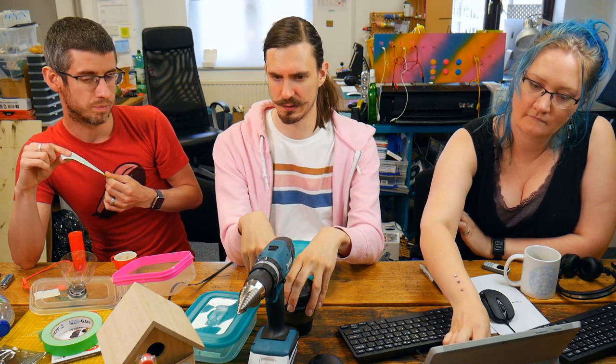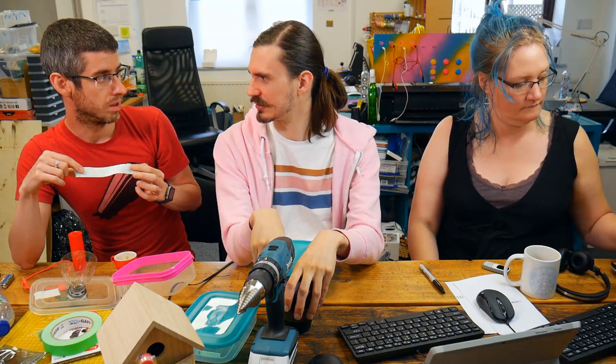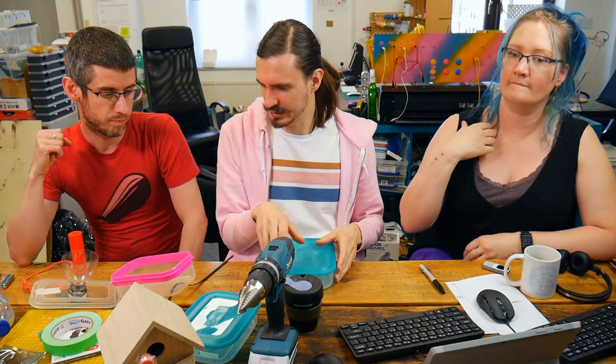We do, in fact. I was going to poke around in the software and see if there's a way to reduce the resolution of the picture that it's doing the motion detection on, because I've already submitted a pull request for another feature on it. Yep. Which could hopefully bring down the CPU load and the temperature a little bit, because it's quite brave to do that on a Pi Zero. It's a lot of work for a tiny computer.